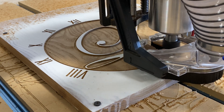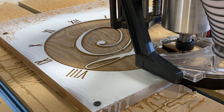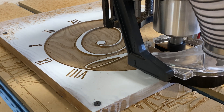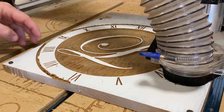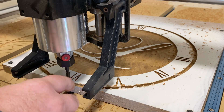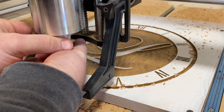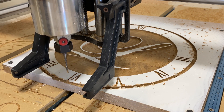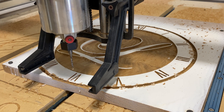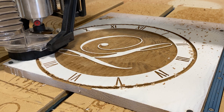Here we see it cleaned up pretty well. Because I was pretty sure I'd gotten all of my issues worked out, I decided to go ahead and use some walnut and it turned out looking very nice. Now here's where I did make one small mistake. Remember how I told you I wanted to use a downcut bit for all the profiles? I forgot. I actually changed the path in VCarve to use my eighth inch downcut bit because I don't have a quarter inch downcut bit, but then I forgot and cut it with a quarter inch upcut bit. So I let it pass one time, then paused and swapped it out for an eighth inch bit. In hindsight that was really unnecessary because the damage was already done and I had those burrs, so I will have to do a little cleanup and hopefully I don't mess it up.